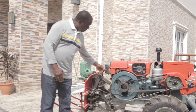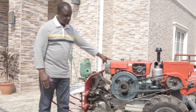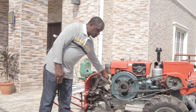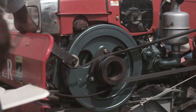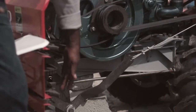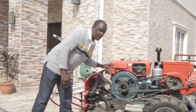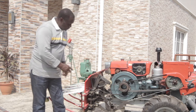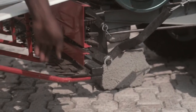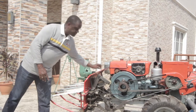The Reaper is actually powered from the tractor engine through the V-belts. We have one single belt that goes to the gearbox, and the gearbox will drive the transporters, which are chain driven. At the same time, it will drive the crank that will drive the cutting knives. So both the cutting knives and the transporters are driven from the same gearbox.